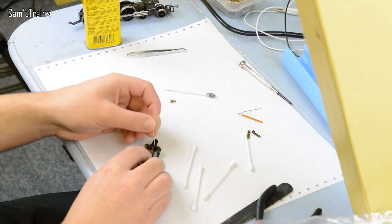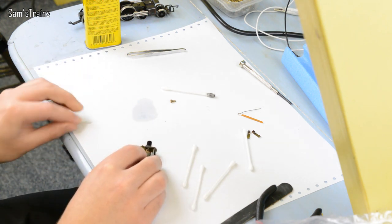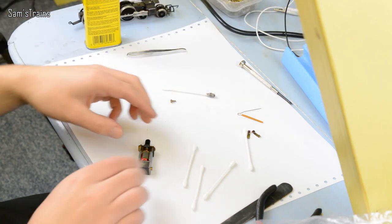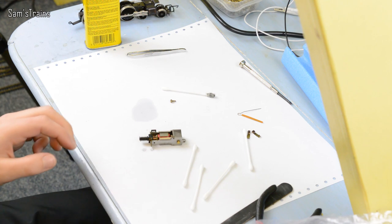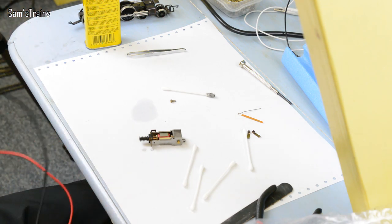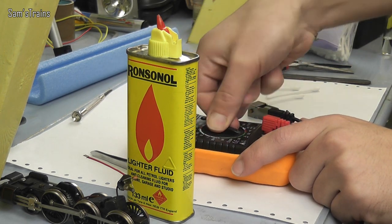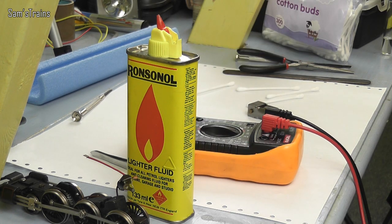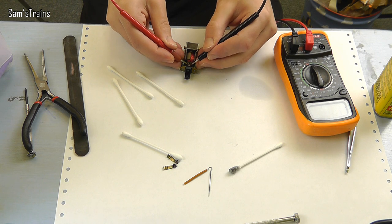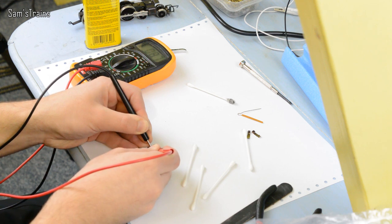I'm cleaning out the gaps with a needle. Normally I've got a towel down here instead of a piece of paper, but it was so dirty after all my servicing I thought I'd use paper instead — it looks a bit more aesthetically pleasing. I won't put the oil on yet — I'm just going to test this with the multimeter first to make sure it's working. This multimeter's had it, but it still seems to be testing resistance. Set that to 200 ohms. What we're looking for is placing both contacts on adjacent plates.